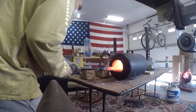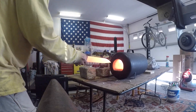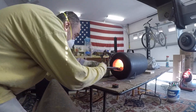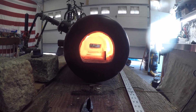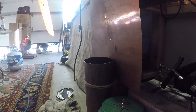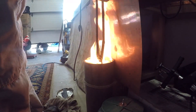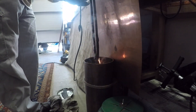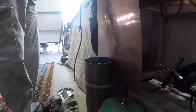You just have to watch not to pick up the steel sideways — when it's so hot it'll bend. It's soft. I hold it vertically, pick it up very easy, and try with a steel ruler or anything to watch that it's straight and not warped. When you pick it up, always pick up straight and dip it in without jiggling it sideways or it will bend. This is a challenging thing — I had to do it twice a couple of times just to make sure the blade is straight when it's hardened.